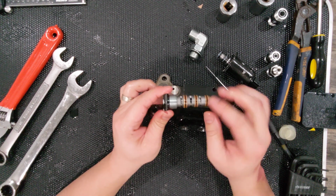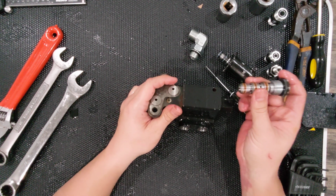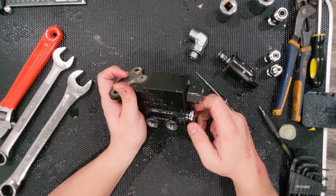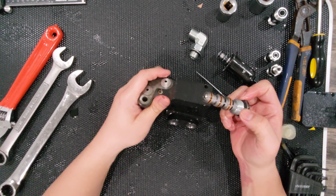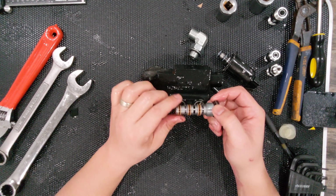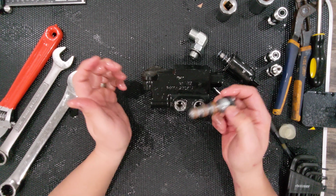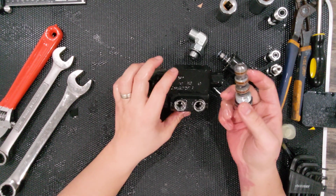One of the questions that came up was, could you just get a new proportional valve? My guess is if you go out and look at all the different flow dividing valves out there, for the most part, 95 or more percent are basically a 50-50 split, which makes sense because in most applications, especially not a mobile application like a tractor, you can just throw gallons per minute at it. And that's really what John Deere's done, I think.